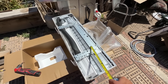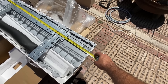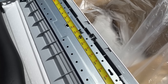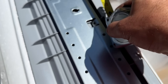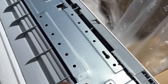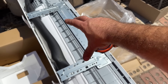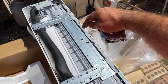Before taking the bracket off, I like to verify where our center point is. We're 43 inches total, so dividing by two gives us 21 and a half inches for our center. Make sure the center of the unit — not just the bracket — is aligned to that mark. On my Mr. Cool unit it was offset and I had to drill my holes twice, so make sure you measure the whole thing and mark the center of your bracket.